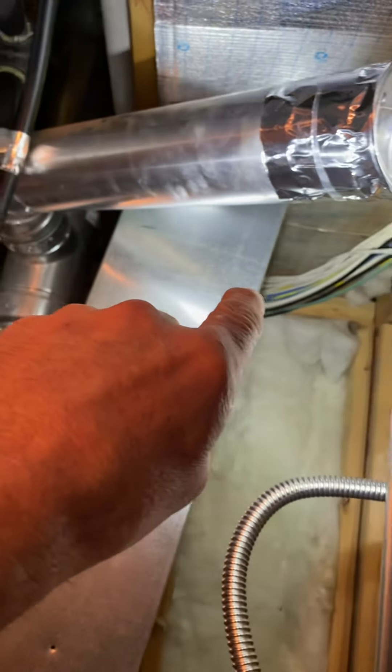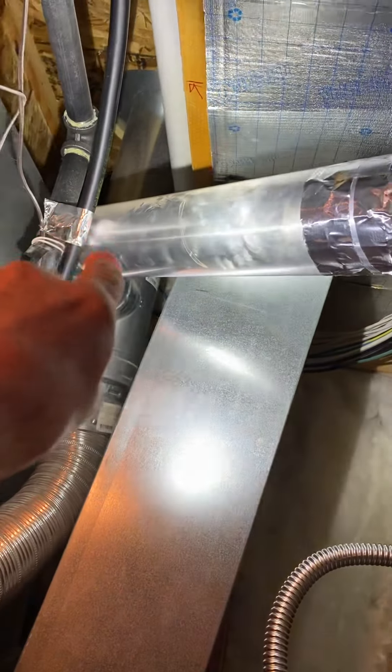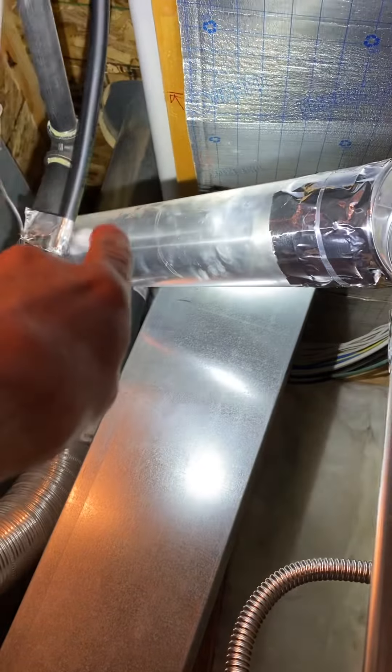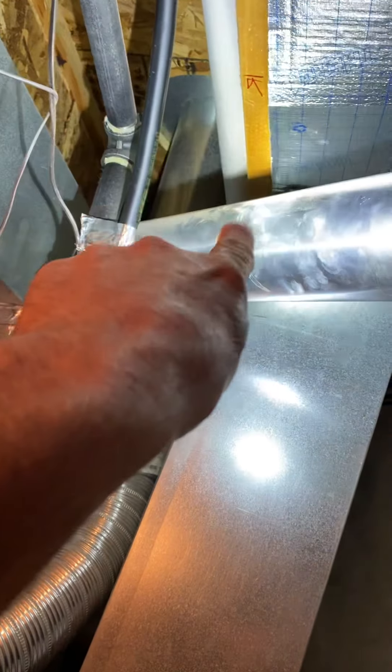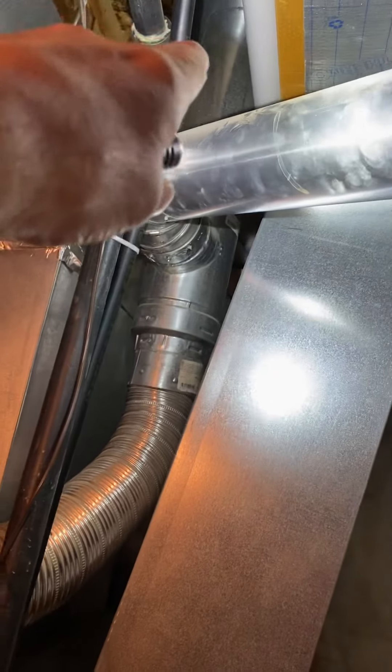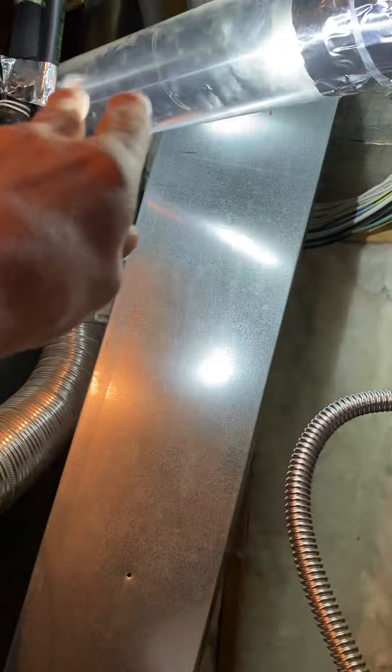I have a little starting collar, and I did give you a little bit of aluminum just in case that starting collar is in the way of that flue. I think it'll be above it because it's only five inches long, but it might be close. So I'm giving you two aluminum 90s and a little piece of four-inch aluminum for that.